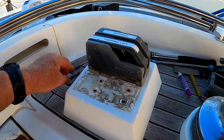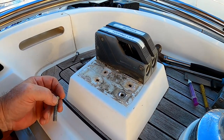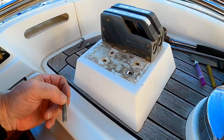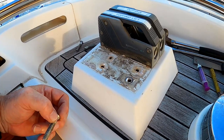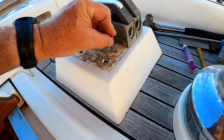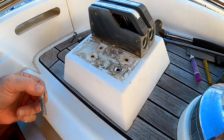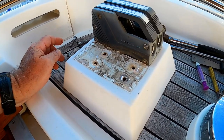This is so typical of every project. I've been trying to replace these two clutches for about a year — calling around, saying I can't get this little block off; it's glued down onto the teak. I tried putting a line around the winch and one of these clutches to twist it off, and it started literally lifting the teak off the deck. They said it's got an aluminum embed plate inside. I take the thing off and sure enough it's got a nut that drops off the bottom, glued on because of the Sikaflex. Pretty frustrated.